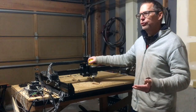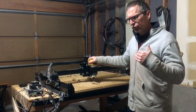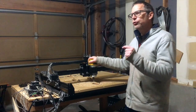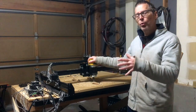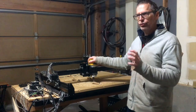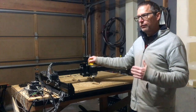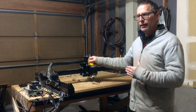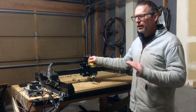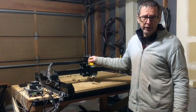I've never tested beyond 150 inches per minute, and I really don't need to because I'm not trying to speed the process up necessarily. When you're talking mass production, 10 to 20 guitars a month or more, you're really starting to look at having to run a machine at 600 to 1,000 inches per minute. To do that, you're going to need a much more robust machine, and unfortunately you're also going to end up having to spend at minimum at least five grand. A lot of those machines start pushing upwards of ten grand.